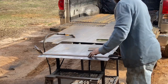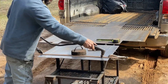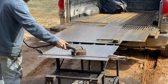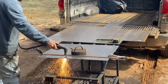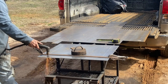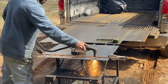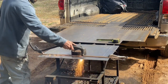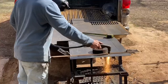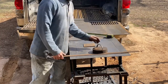I'm just using a straight edge to cut it all out with the HTP plasma. I always leave tabs, and that's why I'm cutting starting at the center and then going back to the top. I leave tabs in the middle of it, then after it cools I cut it out with a grinder. Probably not necessary but I do it more out of habit than anything.